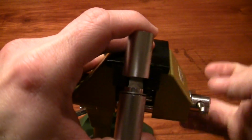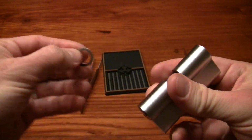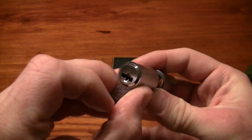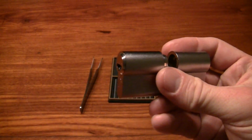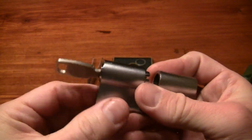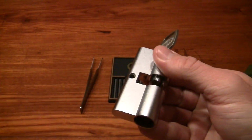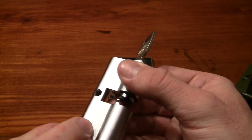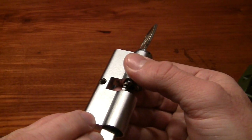So it's kind of interesting. There's a special washer behind the core. Also, the diameter of the core is non-standard, so none of the followers that I have is able to fit there. So I'm forced to do the gutting in somewhat non-orthodox way.